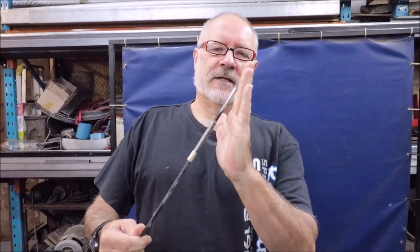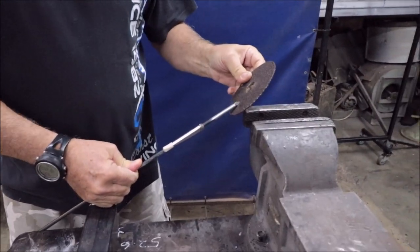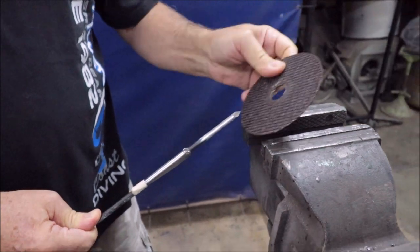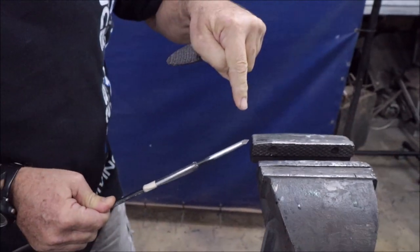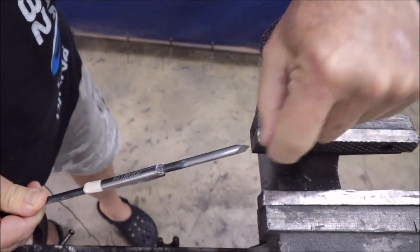So, in conclusion, this facet needs to be set exactly at the same angle as your angle grinder. So that facet lines up on the disc and your visual is directly from above, monitoring the dorsal edge and the two sides.